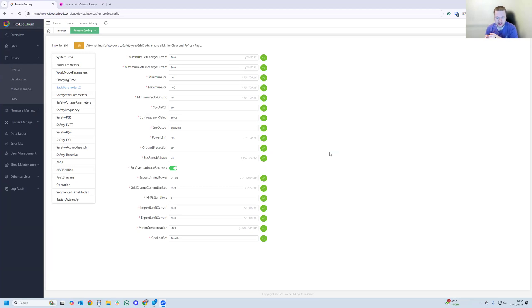As of the 13th of January 2025, on the installer or agent options — accessible through the front panel or via your installer — there are new options at the bottom of the screen. You're able to set an import current limit as well as an export current limit. For most single-phase supplies you'll be on an 80 or 100 amp limit. If you've got an EV or multiple EV chargers, heat pumps, and a battery system that charges in the off-peak, you can set a current limit — I've set mine to 95 amps.